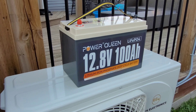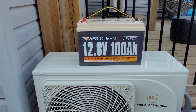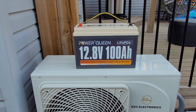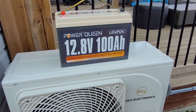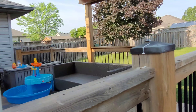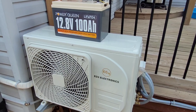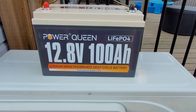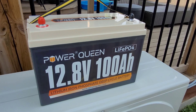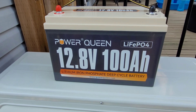This is their 100 amp hour model. It's got a 100-amp BMS, meaning it can discharge at 100 amps DC continuous without overheating or causing a problem, and it'll do that for about an hour — that's where it gets the name 100 amp hour. Running around 400–500 watts, this thing should be able to put out a little over two hours of runtime on one battery. That's going to be awesome for the days where the sun goes down and you just need a little more life out of this solar AC without tying to the grid.